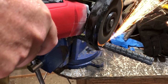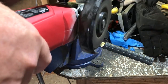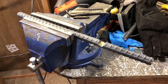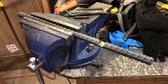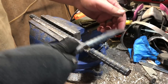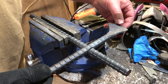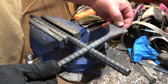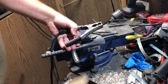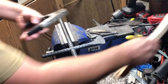To prep for the welding, I'll be cutting a notch in the head and also cutting a notch in the handle. I'll do that with the grinder. If you don't have a grinder, you could definitely use files — you could even heat it back up and use a hammer or some type of hardy tool. But realistically, a grinder is not a particularly expensive tool and I think it's a great investment for a knife maker, a blacksmith, or any kind of metal worker. Once I have the notches cut the way I want them, I fit the pieces together and did a little bit more finishing work so that they would fit really flush.